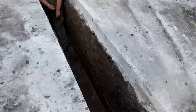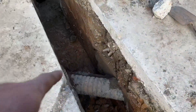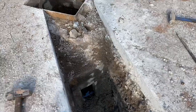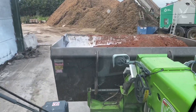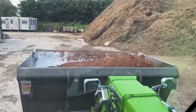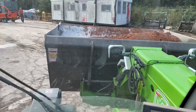Project drain — it's like the Channel Tunnel. Underneath these pipes here, underneath that duct, there's a water main as well. In through that hole and into the old block manhole. Just put some ash over the top of the pipe for the boiler, and some pipe bedding around the two pipes we're putting in. I've got some crushed stone that we made yesterday to go on top of it all to fill the hole back in. Then we'll concrete it at a later date when it's settled.